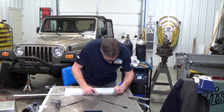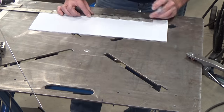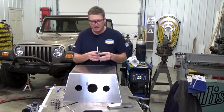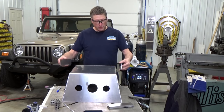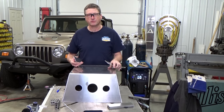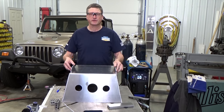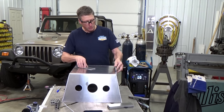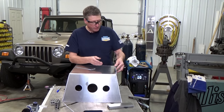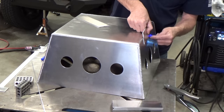You should have another piece of drop-off about 8 inches wide by 19 inches long — that's enough to cut 8 pieces 2-1/4 inches by 8 inches. These are going to be welded on the outside but in line with the bottom support tubes. They basically serve as a tire stop in case the vehicle rolls on the stands. They're welded about halfway up — about an inch to inch-and-an-eighth — with a 2 or 3 inch weld on the inside and then weld the outside corners.